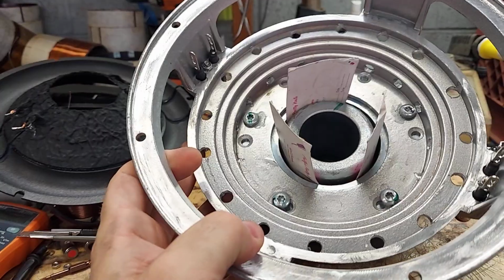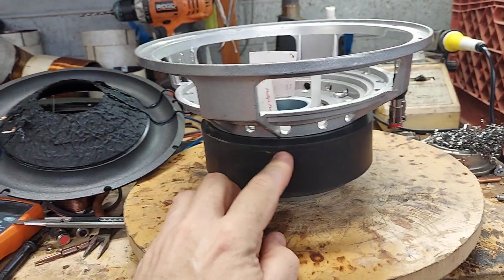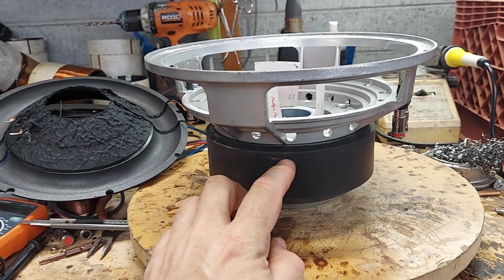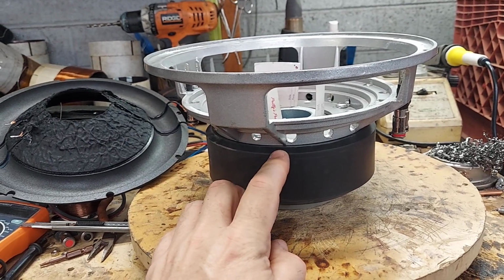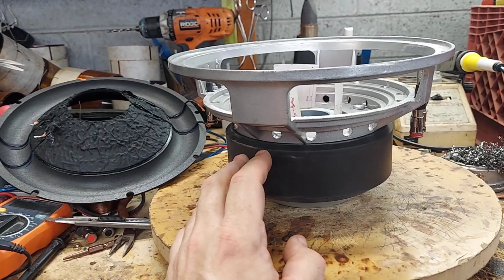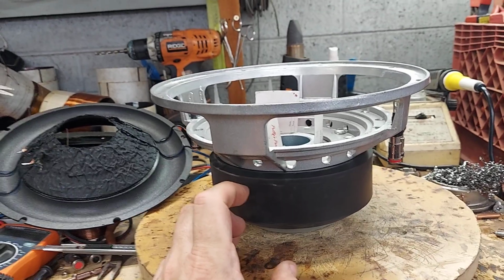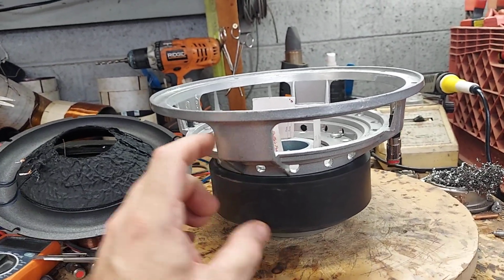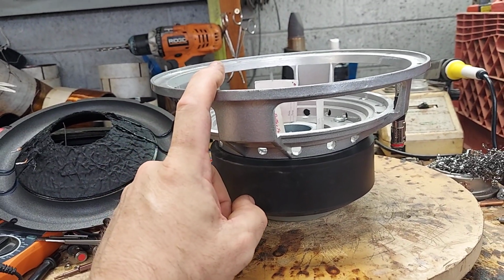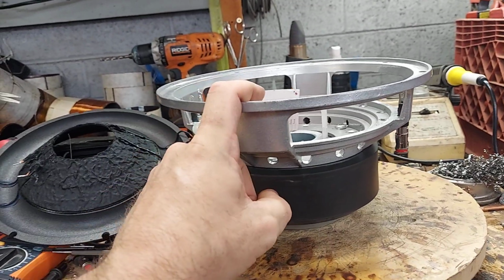All I did was, just so you know, just for information, the W6, the 10-inch W6 motor, is slightly smaller. It also has a slightly smaller bolt hole circle, and it uses a 5-bolt pattern, which again, in my opinion, is very dumb. And then on the original frame, it uses a much bigger spider, which is a mistake, because what ends up happening is it wears heavy on the surround, and that's why you end up having to refoam, not recone, but refoam. The foam surround wears out first, because that's the weak link.